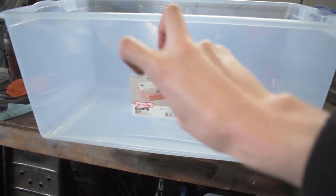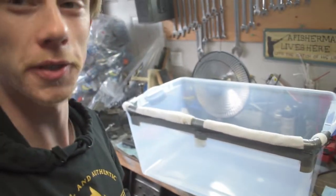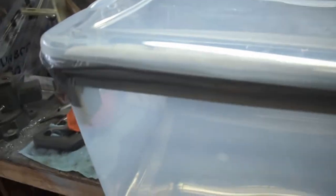The first thing we're going to need is a cabinet — mine today is a 99-liter clear tub, and make sure you get one with a lid. We're going to need to seal it so you don't have stuff flying everywhere when you're sandblasting. Since this lid isn't pre-sealed, I made my own seal using some old shop rag, and it actually works out pretty sweet. If you pick one that already has a sealed lid, you can skip this step entirely. Either way, we now have our seal done and when you put the lid on, it clamps in nice and tight.